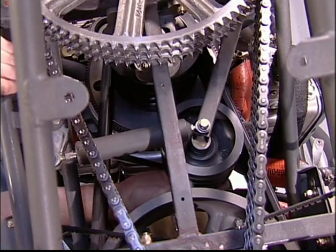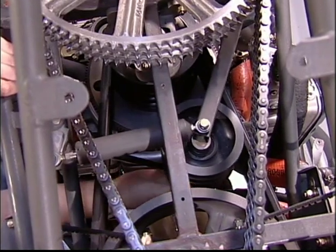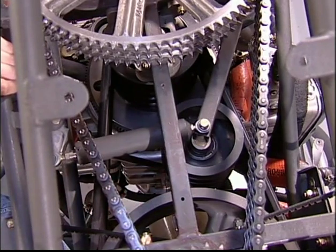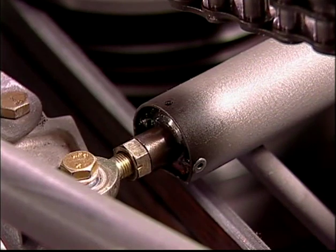Verify the proper adjustment of the clutch spring tube weldment. When the clutch is disengaged, the idler pulley should just touch the main drive belts and not deflect the belts outward. The piston should be against the rivets.